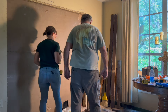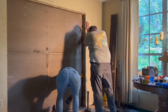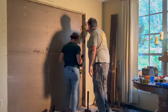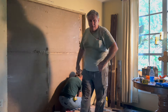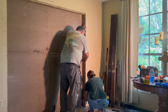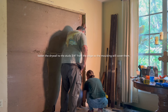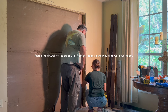Do the other side. We had a couple of drywall screws — that was faster. Keep them about three quarters of an inch away from the edge. The molding will cover it when we put it on.